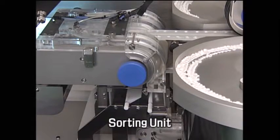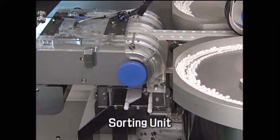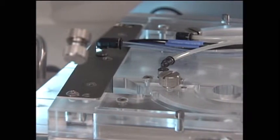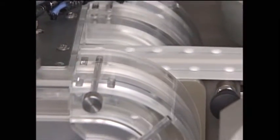While conventional separation methods incorporate a mechanism for rejecting defective product, the VIMT uses compressed air to send non-defective products to a separate line, one tablet at a time. This design is an extension of the fail-safe concept and ensures that defective and non-defective products are not accidentally mixed in the case of momentary stops or mechanical failure.